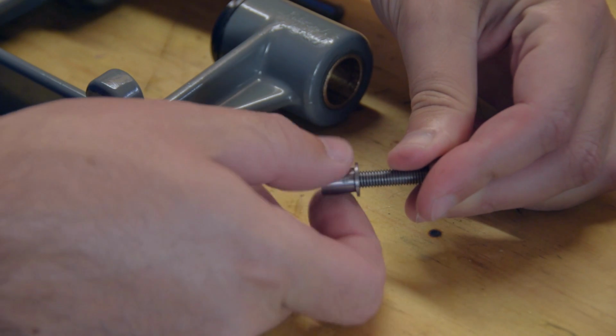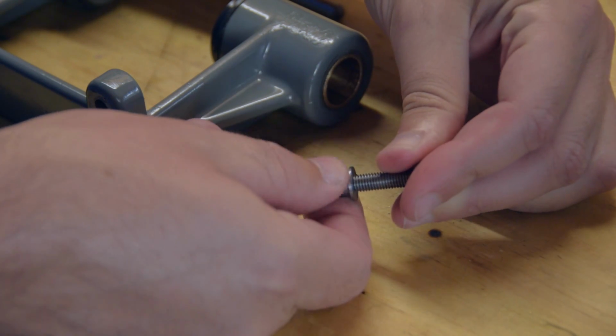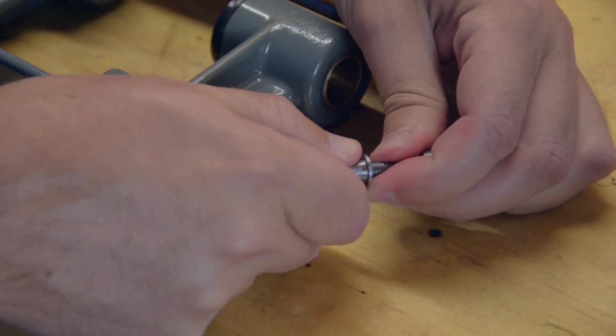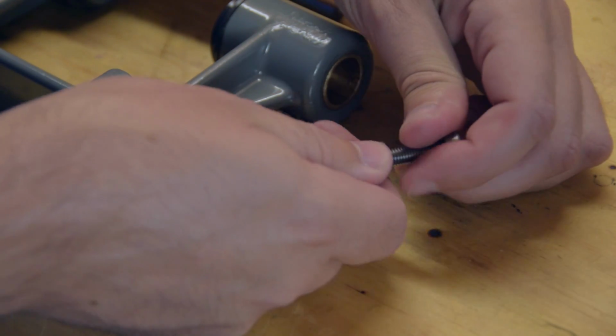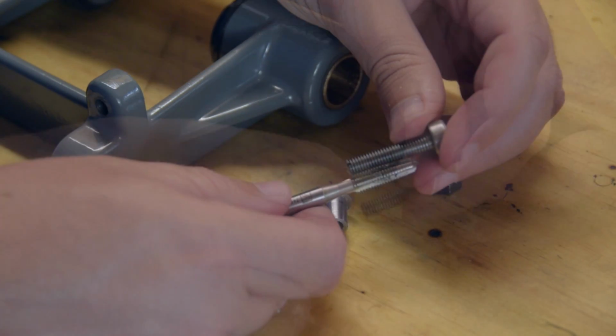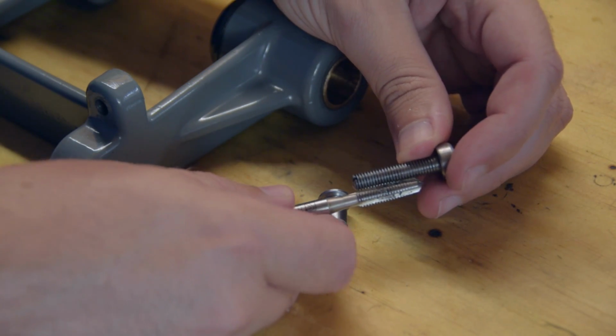For some reason, I can't thread the insert onto the screw. Lucky I tested it first. My assumption is that I've cut the wrong thread. It does get a bit confusing on British machines of this era. It took me a while to figure out what was going on.